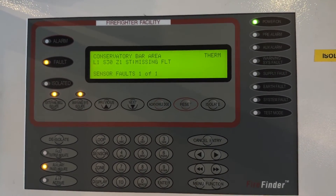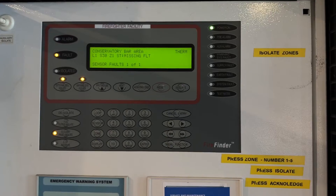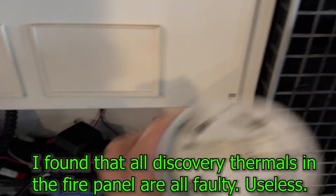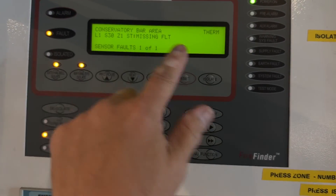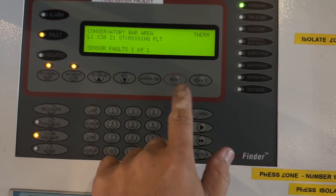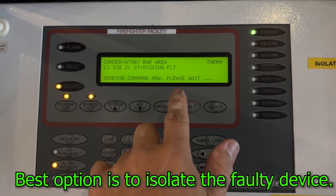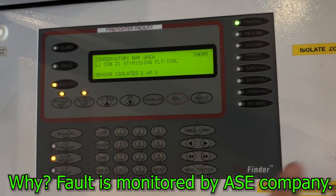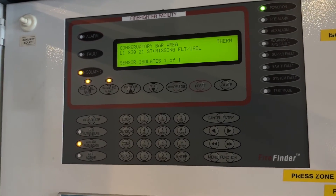Unfortunately I cannot solve the problem today because I don't have a spare Discovery detector — XP95 does not work here. There are lots of Discovery detectors here and they're having problems. The issue with this bus system is the only thing you can do is isolate that particular detector — not like the Petronics where I can temporarily delete it. When I return I can bring it back. For the meantime, until the problem is fixed, you have to isolate that detector and it will buzz every eight hours.